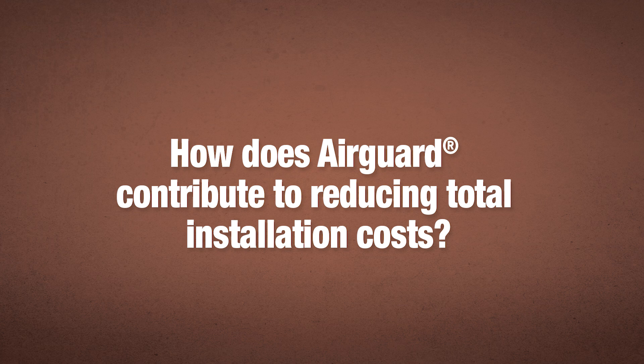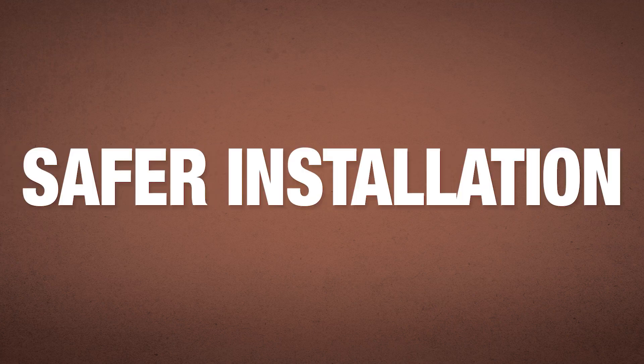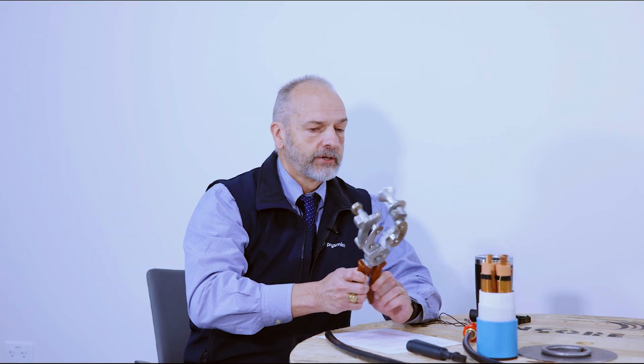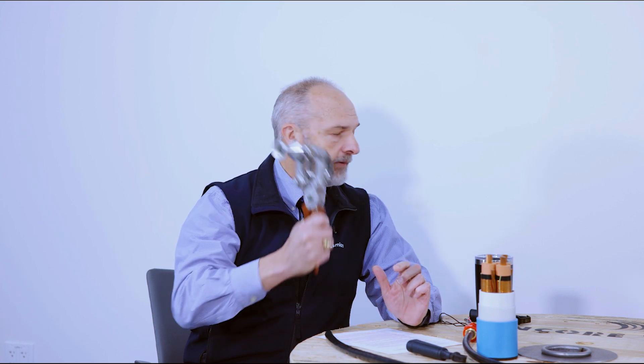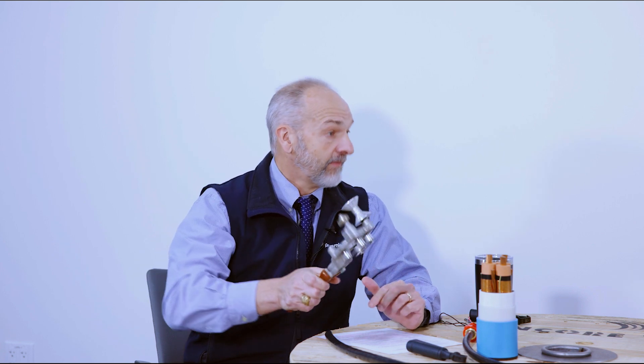How would you say AirGuard can help reduce total installation costs? Right off the bat, with AirGuard you don't need a knife or a saw. We're definitely going to save money for the contractor. It's also going to be a much safer installation. For larger conductor sizes — four ought and above on low voltage — you use this tool, make a regular cut, a longitudinal cut. It goes much quicker and the chances of damaging the cable are virtually impossible.